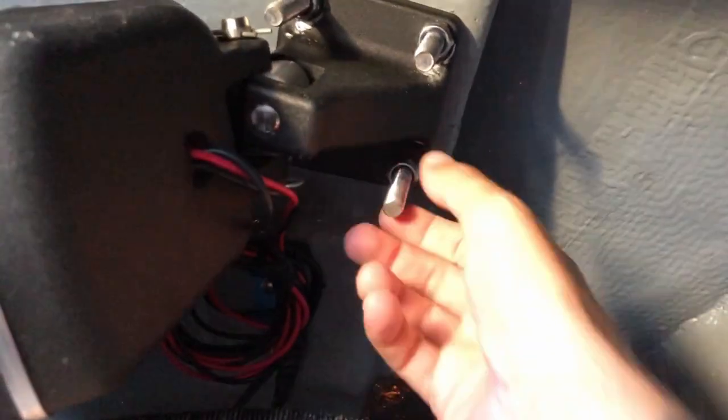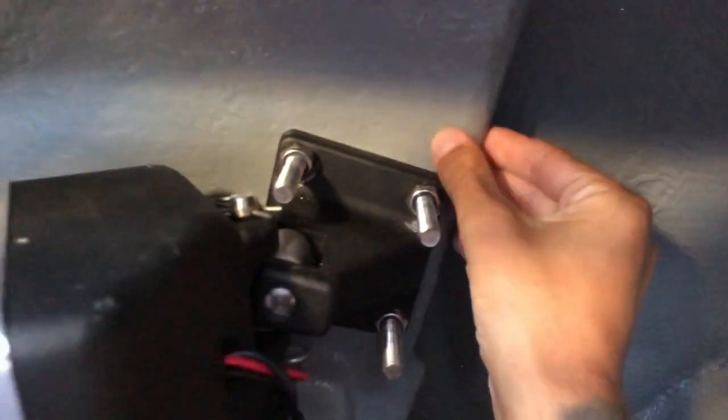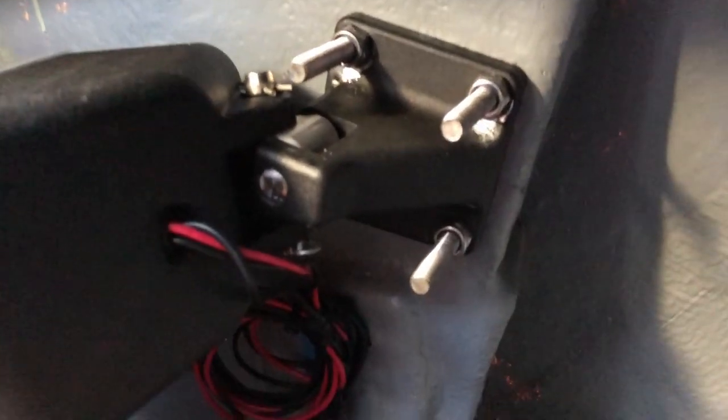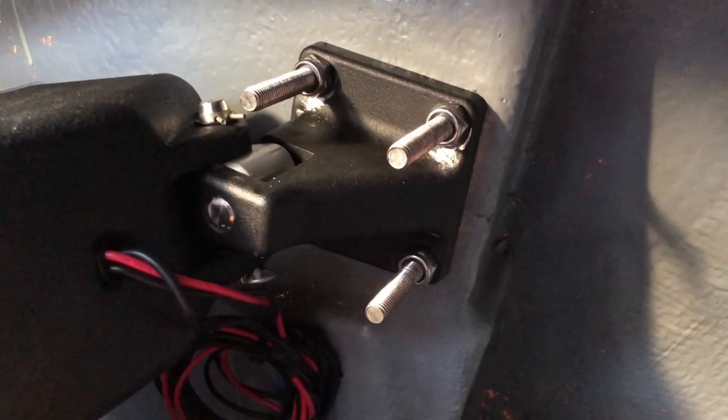Yeah, probably. All right. So this will show you the plate on the outside, where the linear drive's been mounted. As I said, the forces are effectively that way, which shouldn't create too much of an issue. The corner here is obviously a bit more built up because it's a corner, so you've got a bit more strength to it anyway on the fiberglass. Instead of building out a bit of a shelf here that we thought about, or even glassing in a block here potentially, we made the decision just to put four holes in the back of the boat instead, which seems to have done the job.